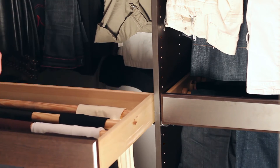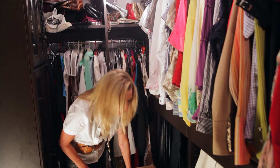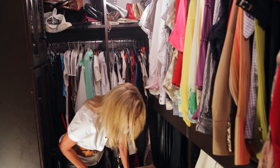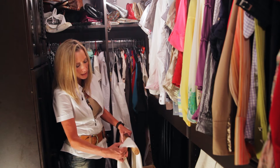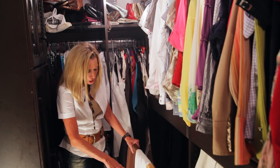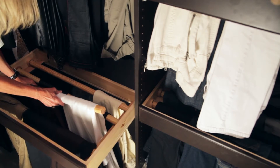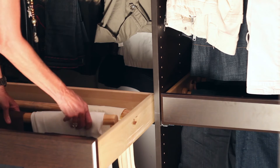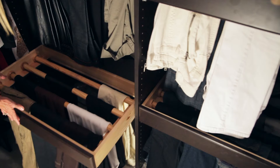If we open this up, this is nothing more than a drawer glide. What I've done is I've taken an inch and a half dowel — and you definitely need to stay with an inch and a half dowel so that when the pants go over it, it doesn't crease. You cut out the bottom of the drawer, and you place the male-female connections that the dowels sit down in comfortably. And then it's a great way to store three pants across with four dowels deep.